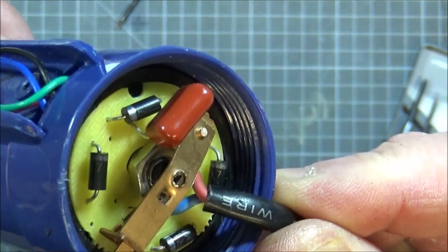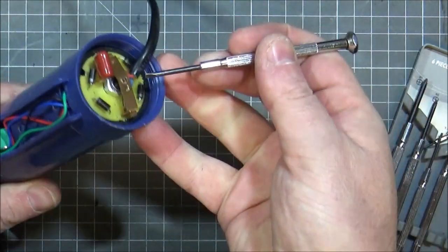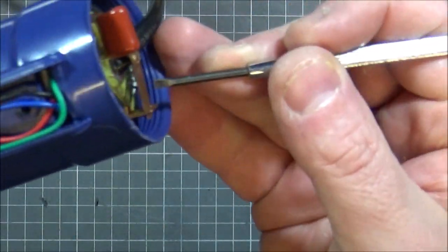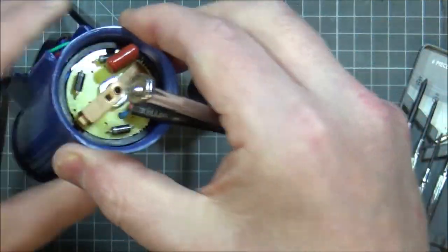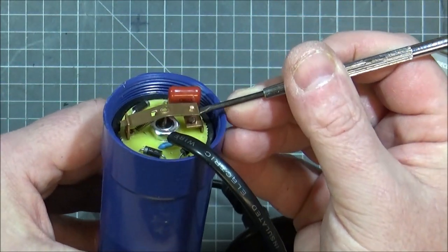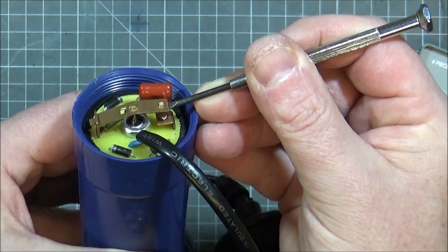Right, okay, so to my eyes it looks wrong, otherwise I've gone completely colourblind. But it goes from there through the, there's three diodes, well, four diodes, and then a capacitor. But there's also this bit on here, which I'm a bit worried about. If you look carefully, there's a spring in there. And then a piece of copper, which I'm assuming is on that side to the left, and if it overheats, it will raise up. At the minute it's down with the spring. If it heats up, it'll go like that, and then the circuit's broken, it'll turn off in theory,